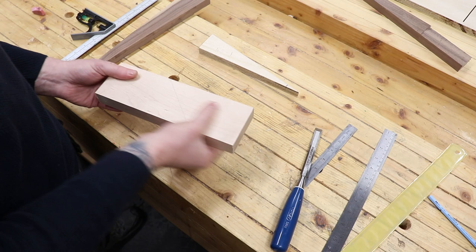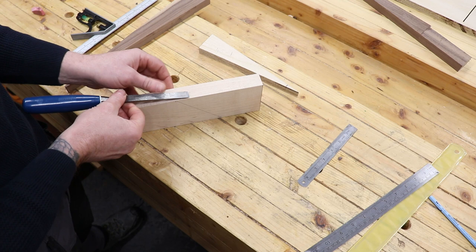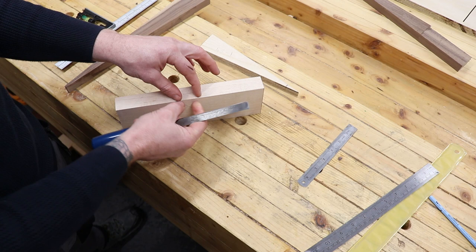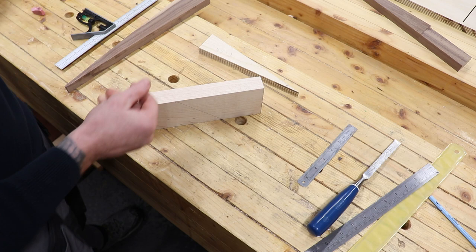This is the piece of material we're going to be using - a piece of maple I've just machined down. It is 10 inches by an inch and a quarter. We're going to be using a 12mm or half-inch chisel, so that will sit in just like that. We have plenty of meat left over because we'll be recessing a section out of this plane to take the chisel. If you're going to use a bigger chisel like a three-quarter or an inch chisel, make sure you leave plenty left over to keep strength in your plane.